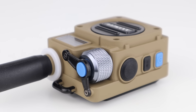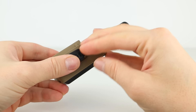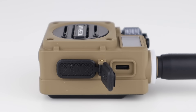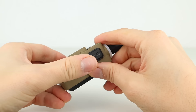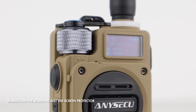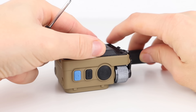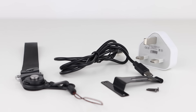On the top is the secondary PTT and the volume and navigation knob. There's also an LED indicator around the SMA 4G antenna socket. On the right-hand side is the USB-C socket, which is for charging and very simple programming, as well as one SIM card slot. On the front is a large speaker and small LCD display. The battery screws into place on the back, and in the box you get the radio, antenna, battery, wrist strap and a belt clip with screws.